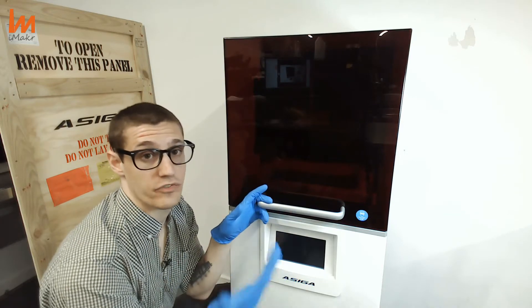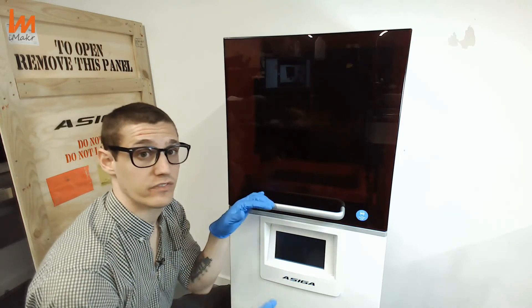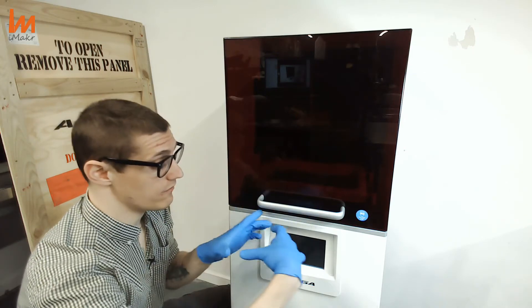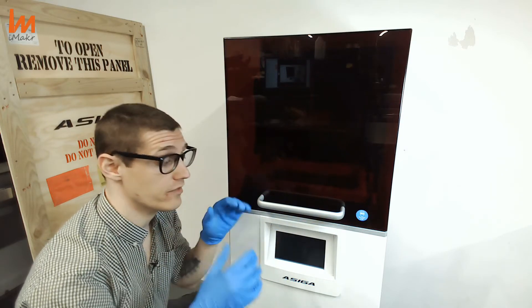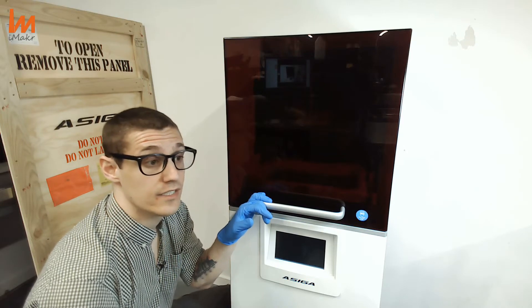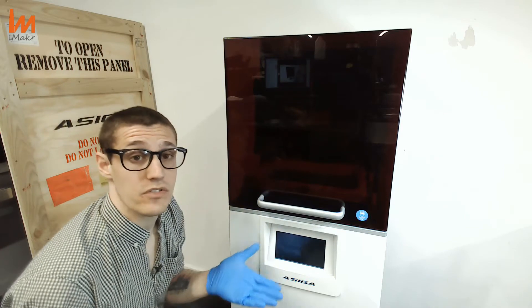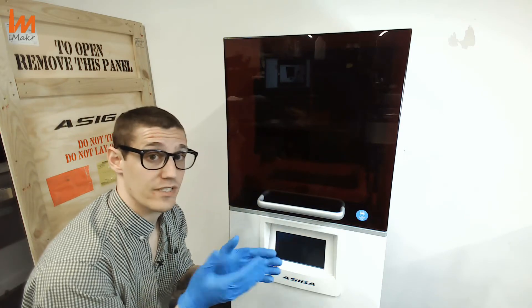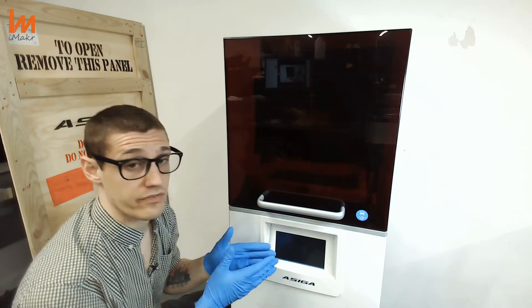It's not an actual function called 'debris,' but you can simply expose the projector for an X amount of time. Basically, you will get a full layer that is easy to peel at the bottom of your vat, and you will be able to take everything out that is not supposed to be there. For some people, this is a waste of material — it might be, depending on your point of view. But if you are not concerned about the cost of materials but about saving time and something went wrong, you just expose for a few seconds.